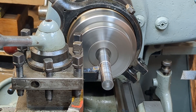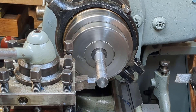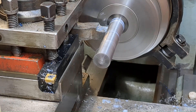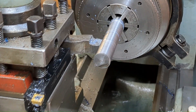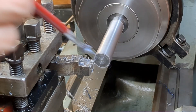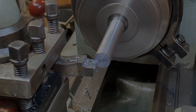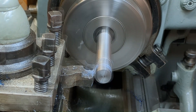At this point I gave insert tooling on my Myford lathe a try for about 10 seconds, then reverted to the more usual high-speed steel tooling. On reflection I should have stuck with a much higher feed rate — with those settings the metal removal rate was really good and the surface finish was good too. I continued the remainder of the work with my regular high-speed steel tooling, but perhaps next time I will try the insert tooling again.